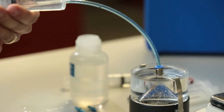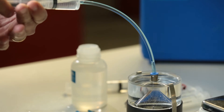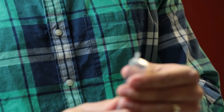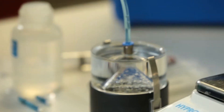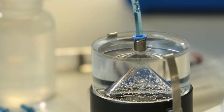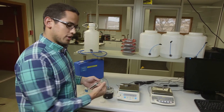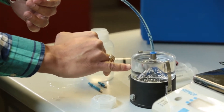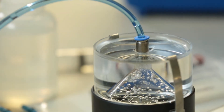After pulling vacuum, release it slowly to maximize the vacuum pulled and remove air bubbles from the system. When you release the vacuum, you'll see a large air bubble — detach the syringe, remove that air, and reattach. Repeat this step several times until you get all the air removed and can pull a full vacuum. When you achieve full vacuum, you should see lots of air bubbles forming in the sensor base. If you don't see that, you're not pulling enough vacuum and won't get a good fill — this is often what results in poor fills of the tensiometers.